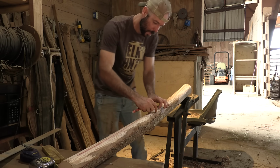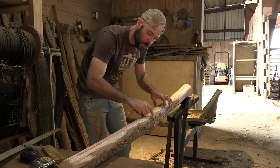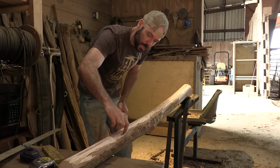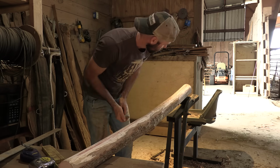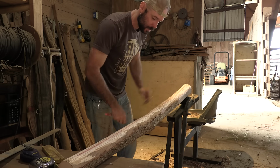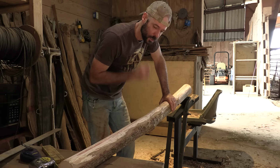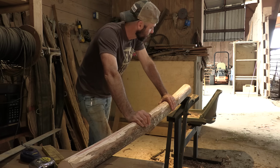So we've got our handles a little over 1 inch wide. We flare out over 2 inches to that 1.5 inches. The limb holds that 1.5 inches all the way out to about mid limb, and then it tapers down to 1/2 inch nocks. It's a symmetrical design. It's exactly the same on both sides, so when we move forward, we can flip this thing over depending on which limb we want to be the top. It just gives you a little bit more flexibility.